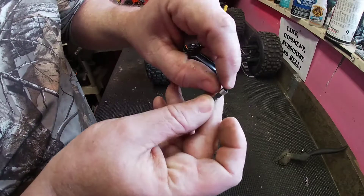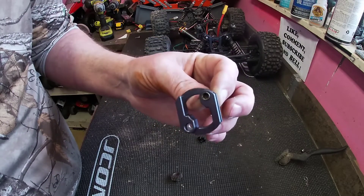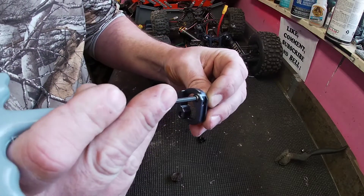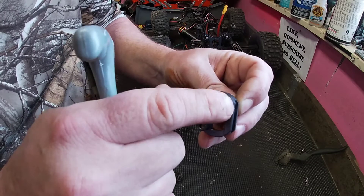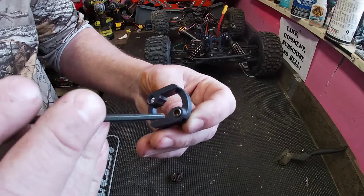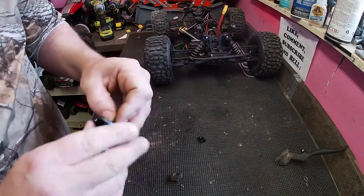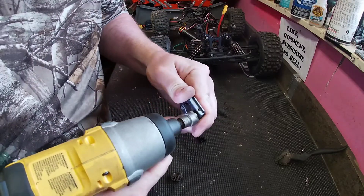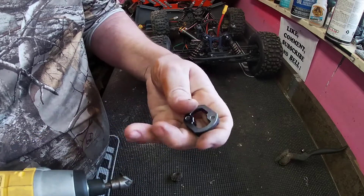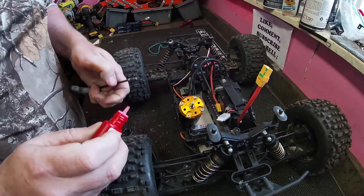The head of this allen bolt is going to stick out a little bit, but it doesn't matter. I could grind it off if I wanted to, but I don't want to because then my allen wrench will only go in so far - and the allen head is already thin-walled from all the material I had to take off. I don't want to give it even more chance to strip out. Every good machinist knows: never leave any burrs. Take your counter-sink and get rid of that little burr on the back side - makes it look a lot nicer too. Perfect.